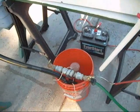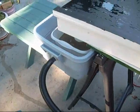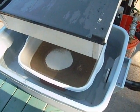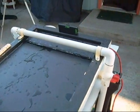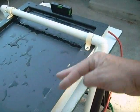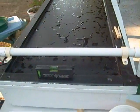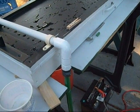The construction of this table is built such that it recirculates out of this five-gallon bucket — it goes back through this line, back up to the top where the concentrates fall out into that tub. I use this valve right here to help control the flow besides the angle. Right now I'm running about three-quarters of an inch to five-eighths. I use a level on top to level it out horizontally, and then there's a hose that comes around to this side and connects back to the pump in the five-gallon bucket.